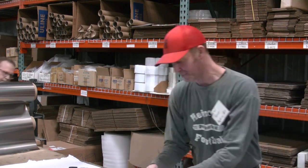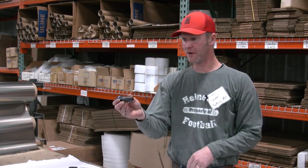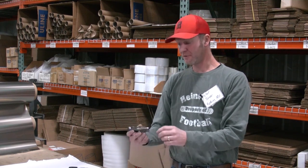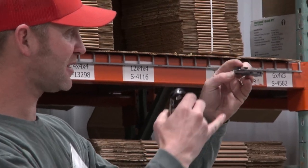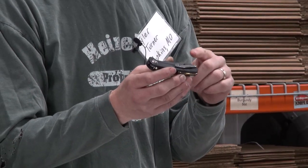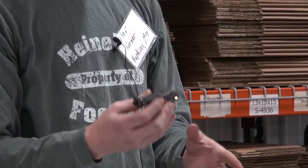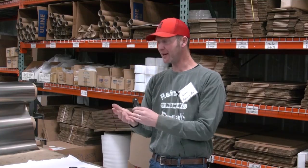I do all my clips now as sculpted, contoured clips. They're all radiused, contoured. I grind everything from the inside, versus these where I would just straight machine the inside like this and they'd stick out prominent, where these are a more sleek clip. These are not bent at all. I grind them how I want them to the shape. A lot more labor intensive, but they fit in your hand better. You don't get that white mark after you use your knife a little bit.